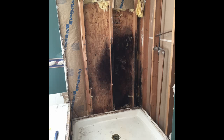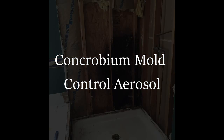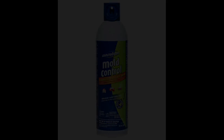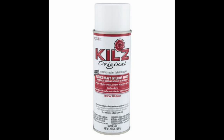I went to Home Depot and purchased, after talking with some of their salespeople, what was supposed to be a pretty good mold exterminator type product. We sprayed the whole area with this mold treatment and scrubbed it. Obviously you wear a mask with this — you cover yourself from head to toe and put a good heavy set of gloves on. You don't want this stuff to become airborne, so by keeping it wet it prevented it from going airborne. After we did that, we let it dry and I hit it with KILZ, just to make sure that nothing would be released again and the mold would be completely covered.